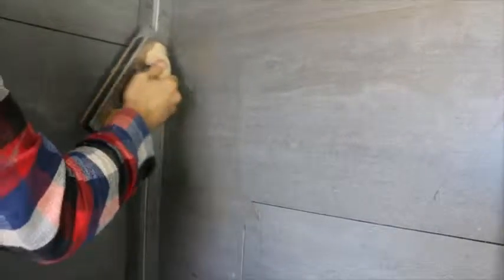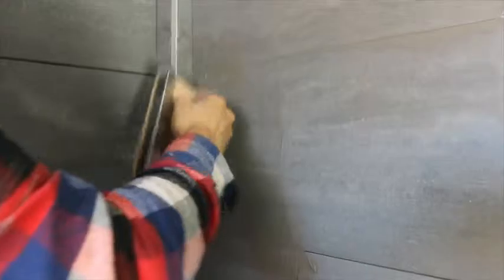Continue on the same wall until you've completed the wall. Do not grout these corners because they're for silicon — go tight up to them full depth, but not into that corner, so keep it out of there. Those little horizontals there, we'll need to grout those between the tile and the edge, and grout all the way down there, but not in the corner. Across all joints.